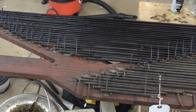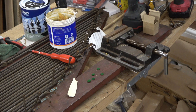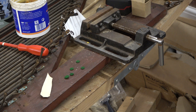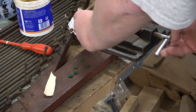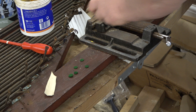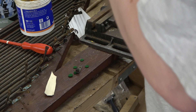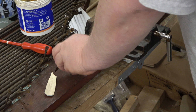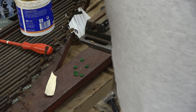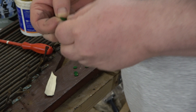What we're going to do is open up the holes because I've had to change the screws from fours to sixes. I've got a small vice there and the correct drill for clearance. I don't have that many screws - five-eighths, number sixes - but I have ordered some more. I think there are 70 coming, which should be enough. We're not taking these out, but we are taking the ones on the right out. If these have had to be replaced, chances are those will have to be replaced too.